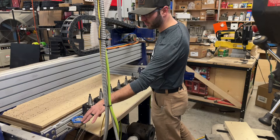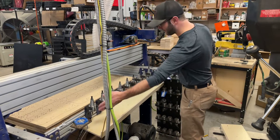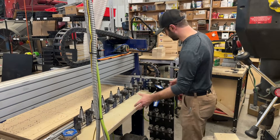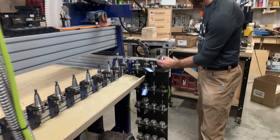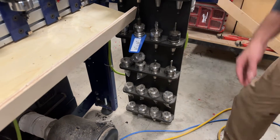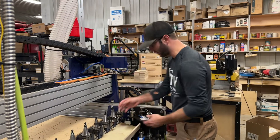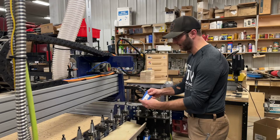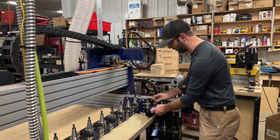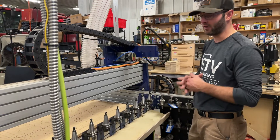We'll swing around to the backside here. We have the Z touch plate that auto-probes the length from the top Z proximity switch and gives us all our tool length gauges. We have nine tool positions on here with varying standardized bits for the different products that we do. In addition to that, we've made a simple HDPE tool holder for all our various bits, as well as additional tool holders if needed. We've made some ID tags that give us the type of bit, various specs, the tool position, and the touch-off lengths that we grab from the controller to make tool switching very fast and efficient.